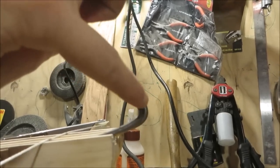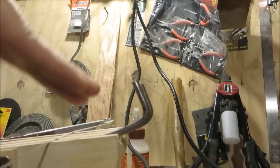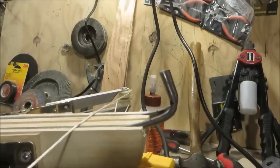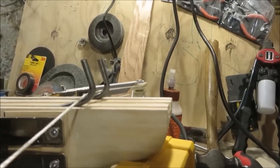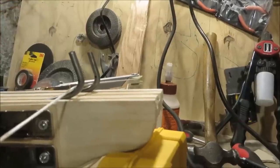As you can see, aside from the main bend right here, there's also a bend right here that sort of curves upwards. What this does is when you draw the loading mechanism back, the downward pressure from the string helps to keep the bars inside the tracks.